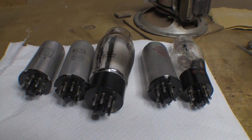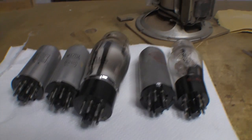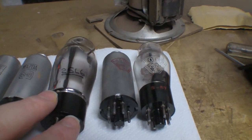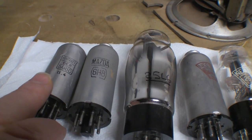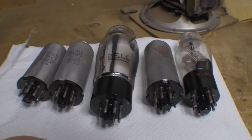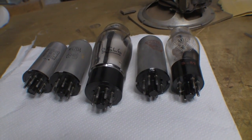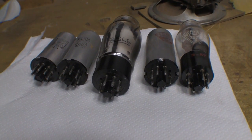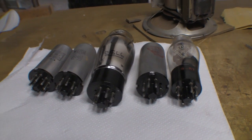Here's the full set. There are no markings whatsoever on this one, but by default it's the 25L6, so I've marked it. The 6E8 is the odd one. I've looked up some documentation and I think I've actually found a master list of reference designs from which this is taken - there's exactly this valve complement, plus discussion about the benefits, advantages, and disadvantages of the design.